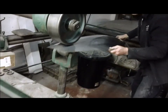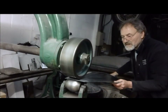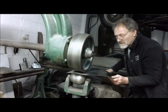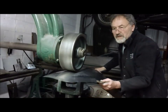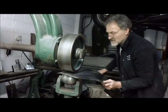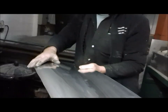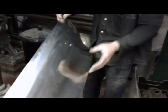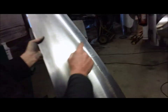All I'm doing now is I'm going to tip that back over. You could do this by hand, but because it's only one point to our leaf, we'll end up putting creases where you don't want them. So we'll just lightly wheel that, and always with a high crown wheel, treat it with respect — don't use any pressure. Use it as an anvil just to pull your panel over. See how that came over? If you put pressure on that, you've just striped it up and made a mess. Light pressure — we pulled that over.